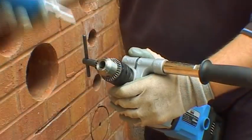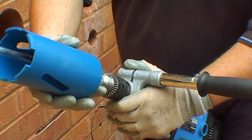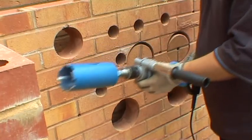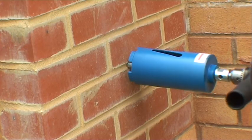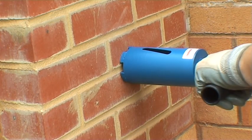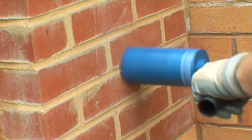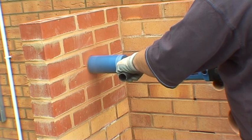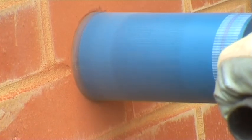It is possible to dry drill general building materials because these materials are normally soft to medium hard and can be drilled without the use of a coolant. PDP's top quality 5 star dry core also allows you to drill through some harder materials such as clay and engineering bricks. This is made possible by using a special heat resistance ingredient in the diamond segment bond.